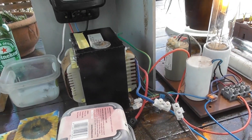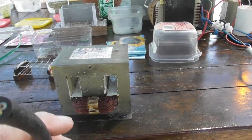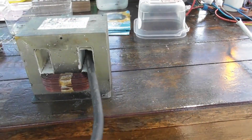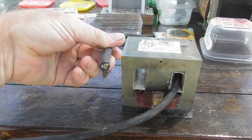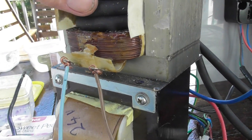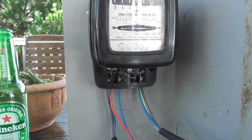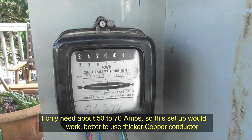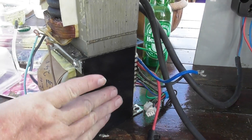I've got the coil removed. At the moment I'm using a 240 to 24 volt transformer on it — almost dead short on the meter — controlled by the variac. I want to put less burden on it, so I'll use three or four turns of flexible cable, maybe some straight light cable with three conductors in parallel. Only three or four turns — it's not critical.